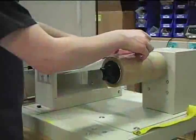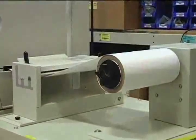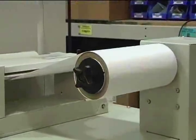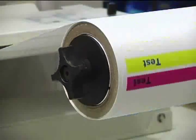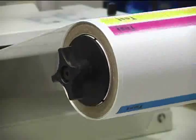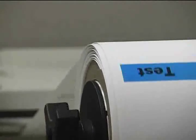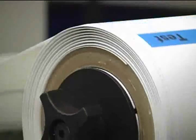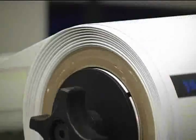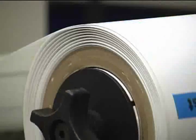This time send a larger print job of about 50 pages. We will now be taping the label stock to the core and activating the rewinder. As the wrap starts, observe the edge of the roll as it grows bigger. If the label starts drifting from side to side on the core, make note of which direction it moves initially. Here is an example of an uneven, ragged wrap. To correct this, we will need to rotate the base of the rewinder so the core is perfectly perpendicular with the label stock. The direction the drifting label wrap moves initially can be a good indicator as to which direction the rewinder should be rotated to fix it.